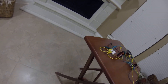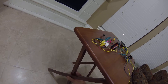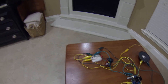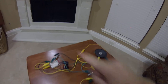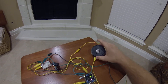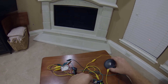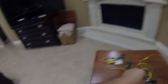There's a bit of misalignment on my laser module and receiver module, so I lined it back up. It's just an infrared receiver I got out of a remote control or something. I've got it biased — driven with a 9-volt battery — and the bias changes, creating little fluctuations in electricity that go into the input of this audio amplifier, run into a very cheap speaker. I have a voltage amplification gain right here.